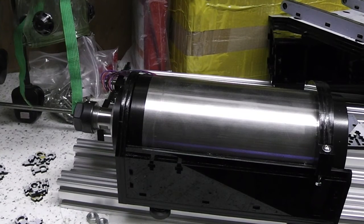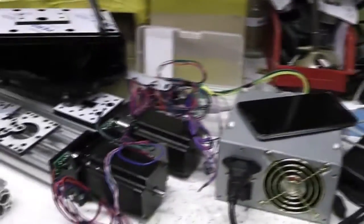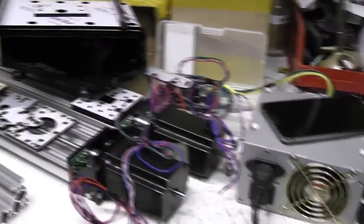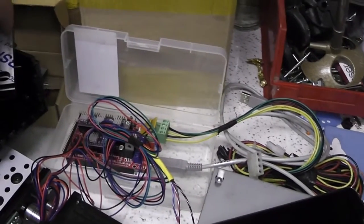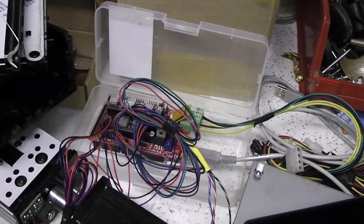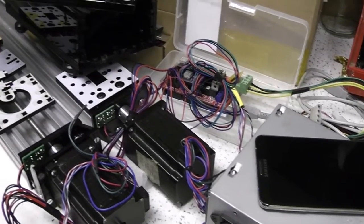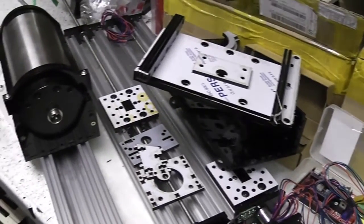Please do subscribe if you want to see more. The most popular video I've done so far seems to be about assembling the motors and electronics. I'm going to be controlling this machine using a Torino — that is a sort of Arduino clone which is very ruggedly built — with the RAMPS board. I've actually been using the Marlin firmware, but slightly adapted for a CNC router. Check back hopefully next week when it starts to look more like a CNC machine. Thank you.